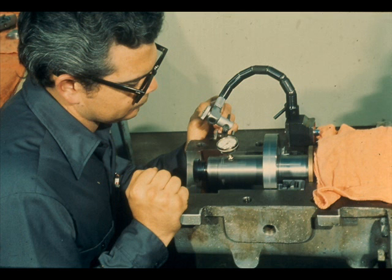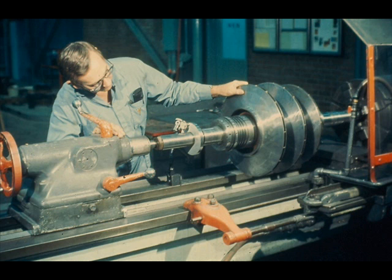If the rotating assembly is removed for other work, these runouts may be checked more easily and with greater accuracy if done on the lathe, as this workman is doing on a compressor rotating assembly. Once the rotating assembly is positioned and the runout of the thrust collar and locknut has been checked, the top half of the case may be replaced and the seal glands tightened before continuing with the installation and adjustment of the thrust bearing.